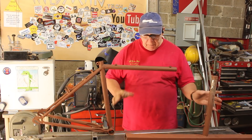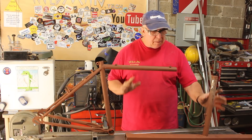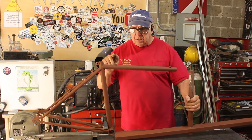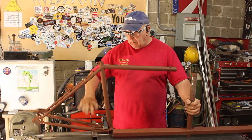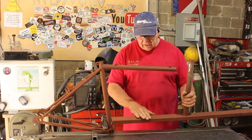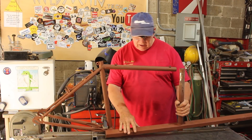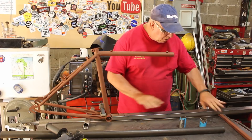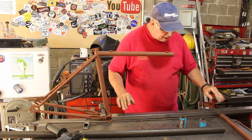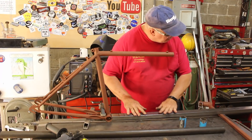I've chopped the frame up a little bit and now I'm going to reorganize it. When the bike is at the right angle, this top tube is level with the ground, so I'm going to rework this so this bar is parallel to this bar. For reasons I won't go into I decided to scrap the other front end completely and just build a brand new one, so I've cut my new tube.